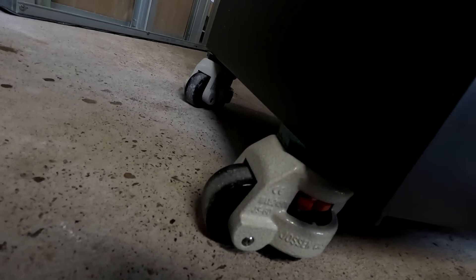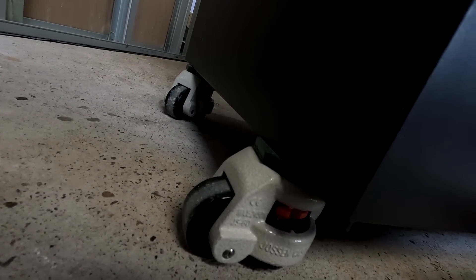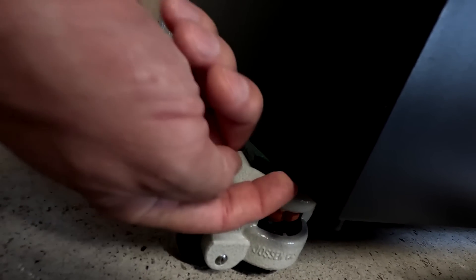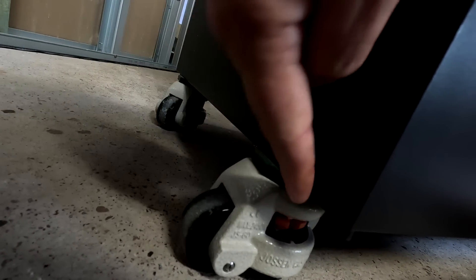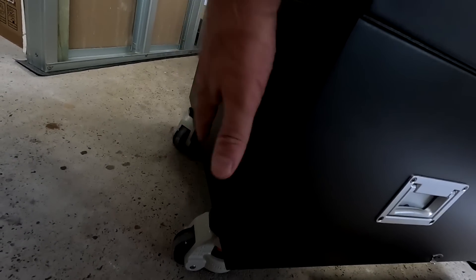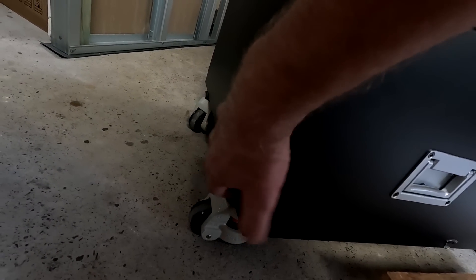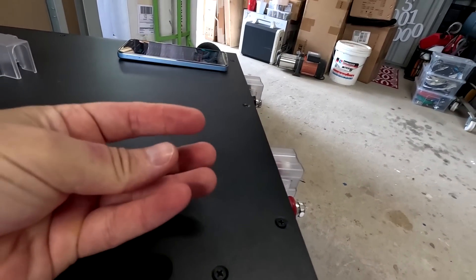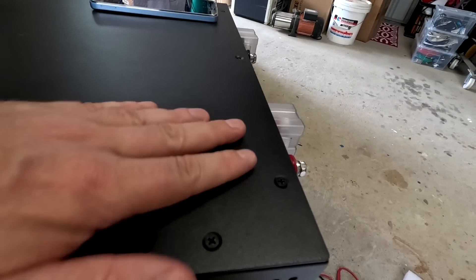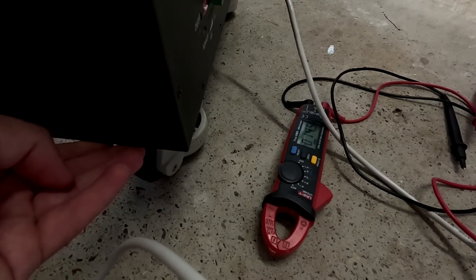They did a different job — not necessarily better — of putting these wheels at the back, all the way to the end of the case. So you've got this corner which is supporting the wheels, and there's also the welded frame inside where the battery cell sits. So there's this welded frame, the back wall, and all this structure inside welded together. This is far more durable than just having a hole with an M10 nut welded on the other side holding the wheel, where the whole metal is not supported anywhere and is basically just too far away from the corners.